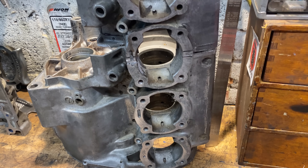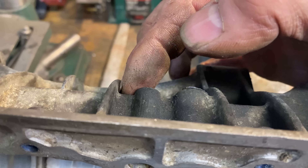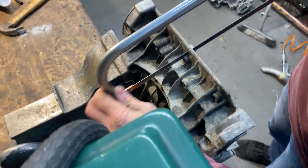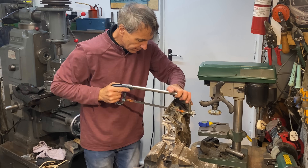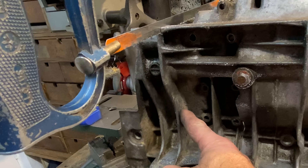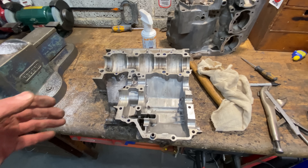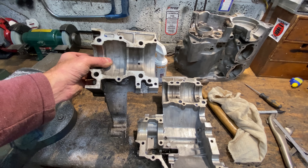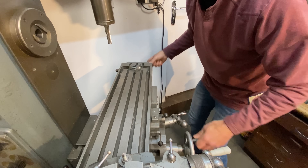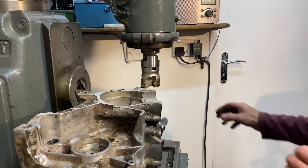I'll have a quick look to see how it fits and I'm really pleased with that — after a little bit of machining that's going to fit just perfect. I now grip the bottom crankcase in the vice and cut to the right of one of the central fins. I need to keep the left hand rear engine mounting point so I cut down the side of the webbing with the saw, and after a bit of cutting I'm through and that section of crankcase is now removed. The next thing I need to do is put all the parts on my milling machine and mill them up so they're nice and smooth. I clamp the right hand crankcases onto the milling machine table with the rough sawn surfaces pointing upwards so I can mill them nice and smooth.